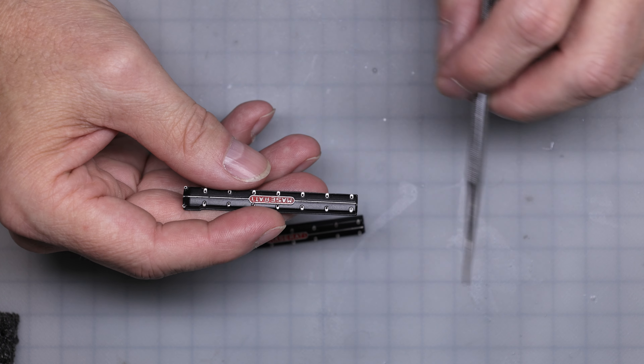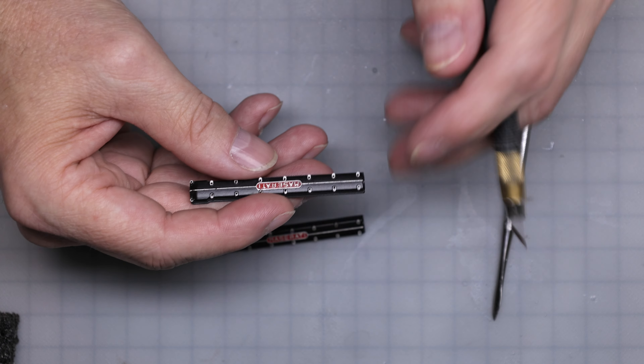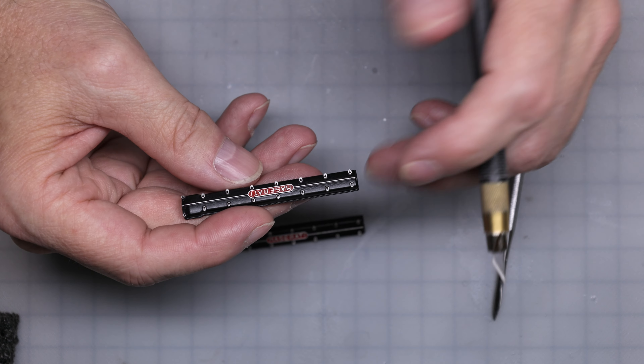I cut out a little mask, masked over this area, sprayed the black, and let everything dry and sit overnight. Then I came back with a sharp blade and just gently scraped the paint off the raised casting areas — very gently so I'm not damaging the underlying material — and then used some 600 sandpaper to gently create a uniform, machine-like surface, only sanding in one direction to impart the sanding marks that would have been done.